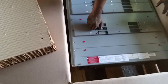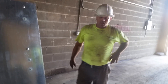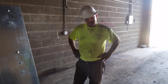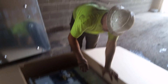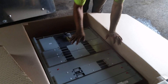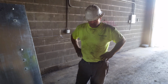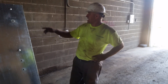When I order these panels I always order them bigger than I need. I originally bid this for 800 amp but I bumped it up to a thousand just to make sure. If you look down here, there are additional spaces for the future. They don't have prints for everything going in here, but that'll cover me - there's six to seven hundred amps I can use.